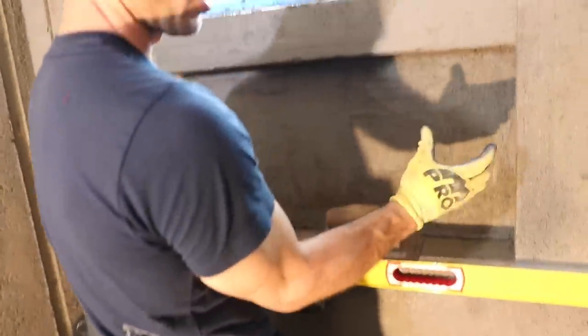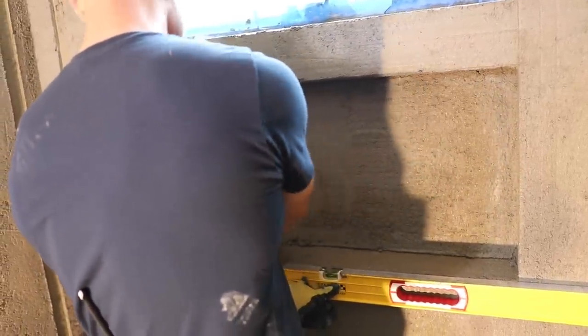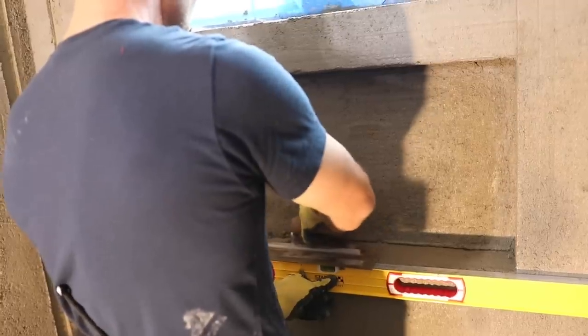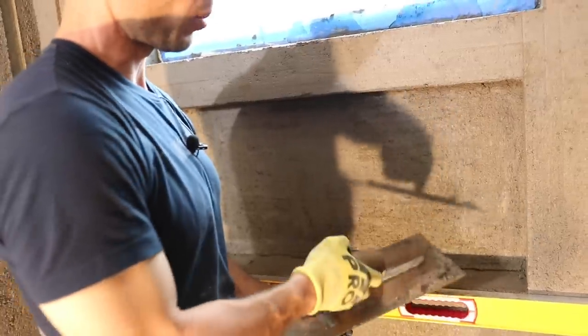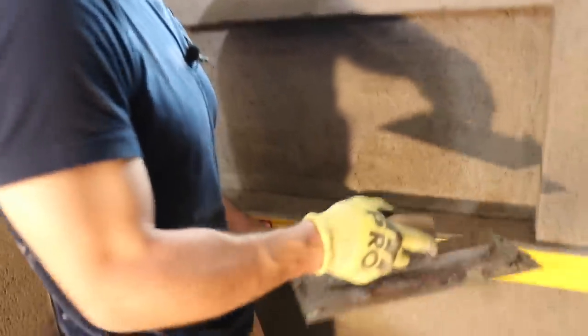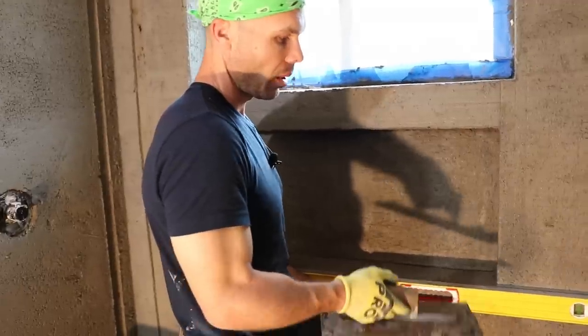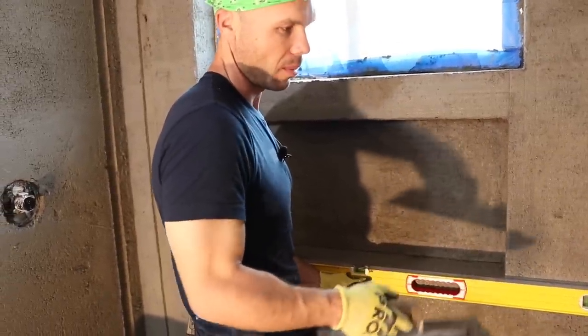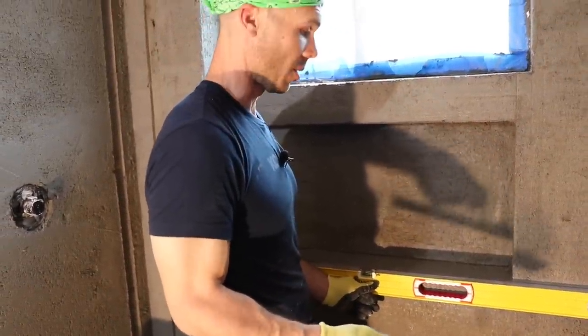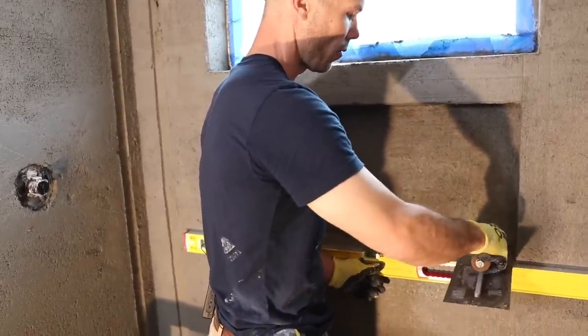You want to be able to put a bar of soap, or a shampoo bottle on and not have it tilt like that. So I'm careful with my slope. Again, I'll put a little on there, but not much. You know, 1/4 inch per foot. If this is 4 inches, that's like 1/8 of an inch at the most. 6 inches would be 1/8. So 4 inches is probably in between 1/8 and 1/16, which is like zero slope if you go on the 1/4 inch per foot. Any more than that, and it's gonna be kind of funky.